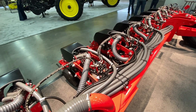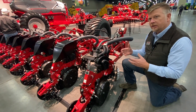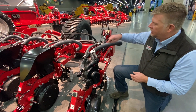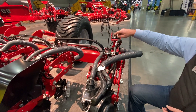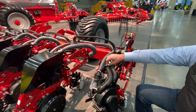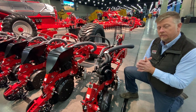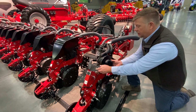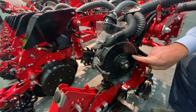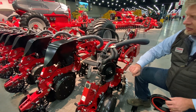One of the unique features about the new Maestro 24-30 SXL is the airspeed metering system. With this metering system, we're taking a very simplified approach to high-speed seed placement when doing crops in the field. The hosing systems on the meter use the big fan to pressurize the toolbar. You can see this hose coming around where it Y's off — we're using one section of the airflow to pressurize behind the metering disc. Rather than using a vacuum pulling air through, we're pushing air through to pull the seed onto the disc, giving us good accurate singulation using a non-adjusted singulator.